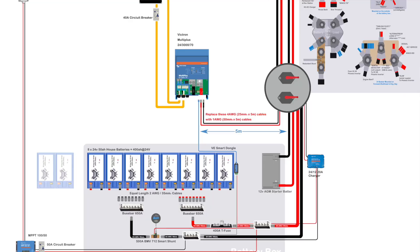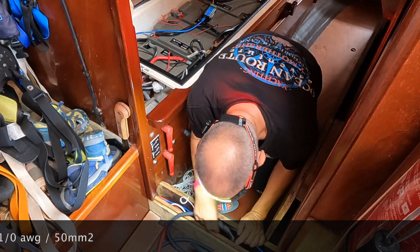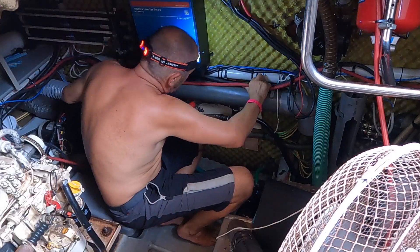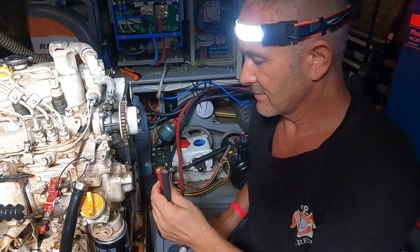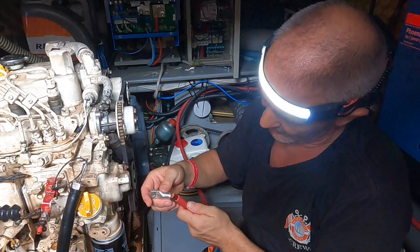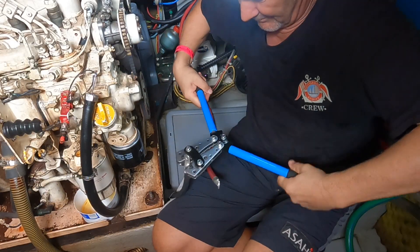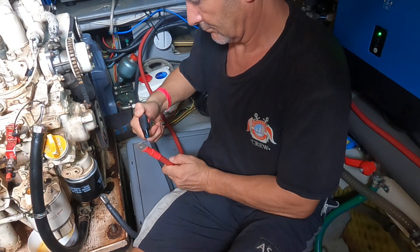As I couldn't pull out the old cables I had to drill fresh holes above the epoxy layer to run the new 50 millimeter cables through. I've become an expert wire puller. I'm just going to tidy up the ends of these because they've gone through a lot. These lugs are 5/16ths — I keep jumping between European standards and American, I've kind of lost track. I couldn't get hold of any tinned wire, but seeing as the old wires which have been in the boat for 22 years were still going strong, I figured it wouldn't matter so much as long as I heat shrink the ends really well.